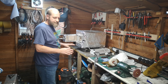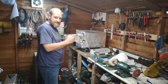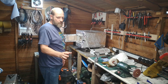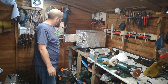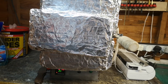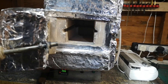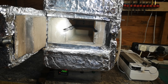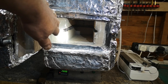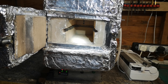Yesterday I was using it at 820 degrees centigrade and it holds within about three or four degrees — it's spot on. The next stage is up to 1050 and then I can start working with stainless and air quenching. I've already spoken to the supplier today about it — you don't need a cryo for the ones I'm going to use, so it should be good. Now inside you can see these are fire bricks, which are really readily available — I'll try and put links for all this stuff.